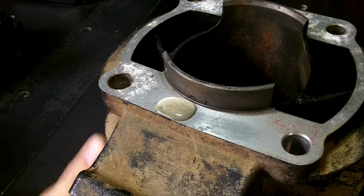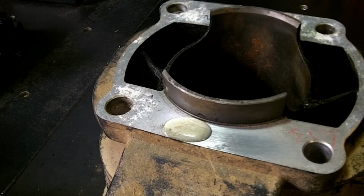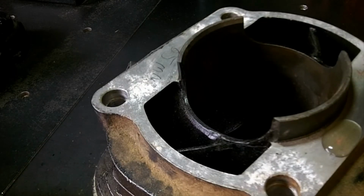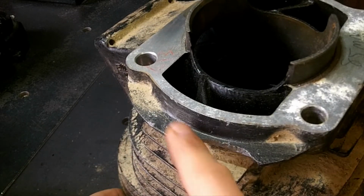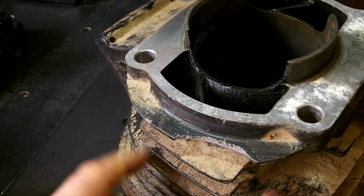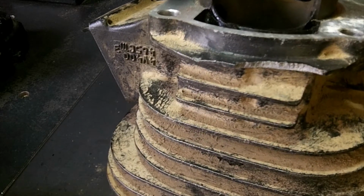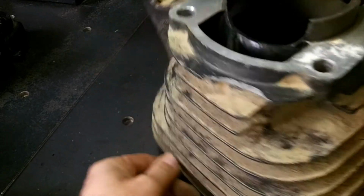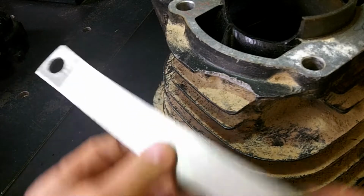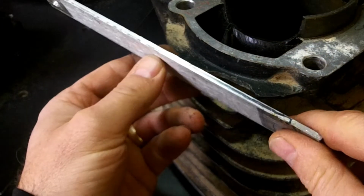I think we're aluminum. So I don't think I need to do the shavings because that's pretty definitive. So we'll go from there. What we're going to do now on the part here is put it in my blaster and blast it clean, so I get all this paint and dirt and junk off. I think I need to hit it with a carbide to clean it up, and then I'll make a piece out of this aluminum to fit in there, and then weld it and grind it smooth, and we should be there. Let's see.